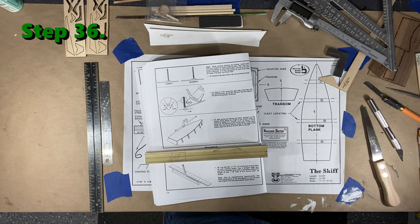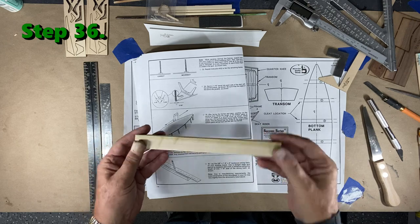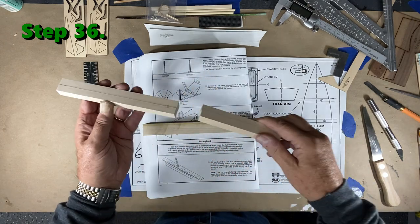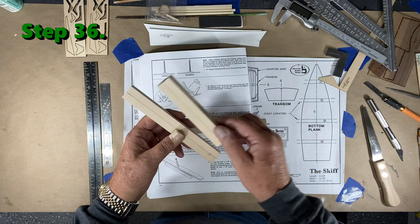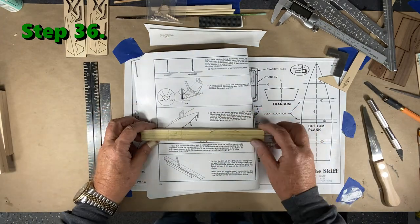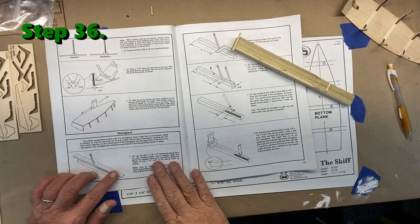When the wood is harder to bend, that's when you'll use a bending tool or some sort of device to heat the wood to help it bend. In your kit there was a block of wood that could be anywhere from nine inches to a foot long. This is the exact piece — it was a foot long. I misread the instructions and cut it to a seven-inch length, which was incorrect, so I made another one just like it.